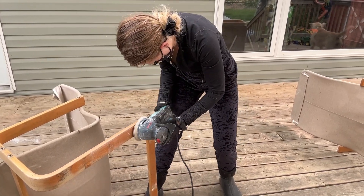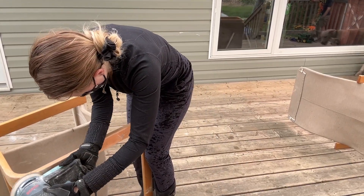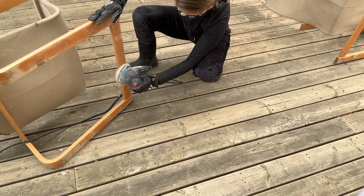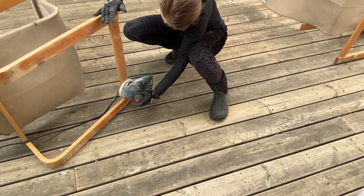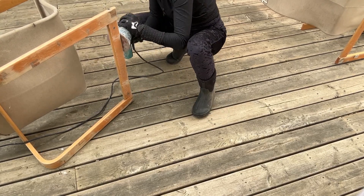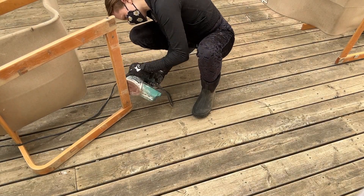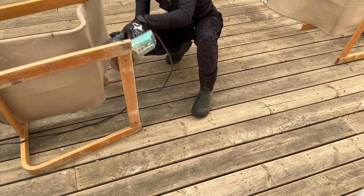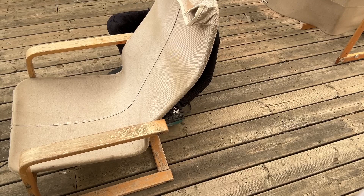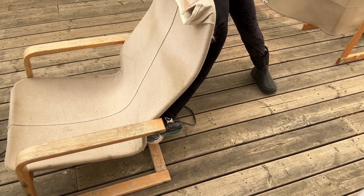I began sanding with 220 grit, which was silly — don't do that. Get 60 or 80 grit for a first pass on furniture because it's going to take way too long if you start with 220, and you're not going to get the finish you want either. My husband taught me you need to go 80, 120, then 220 before you apply the paint. So it's not trivial. You can't just do it in maybe 10 minutes per chair — you want to get the finish correct so the paint will adhere. As you can see, there's a lot of wear on all the surfaces and the top layer really needed to be sanded off.